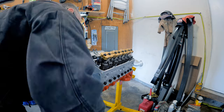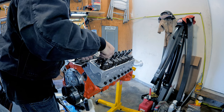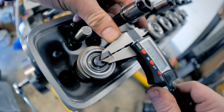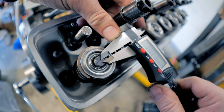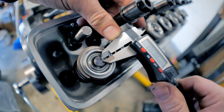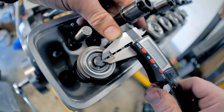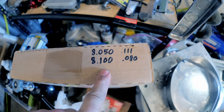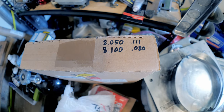With all the slack taken out, let's rotate the motor over — rotate it about three times to get a good imprint, then back to the bottom. Let's check the sweep. That one's a little hard to see but we can still make out the sweep pattern and the two edges. Our sweep now is 80 thousandths — it's getting smaller. So from the 8-inch 50-thousandths to the 8-inch 100-thousandths, the sweep went from 111 down to 80. We're going to go one more size: 8 inches 125-thousandths.